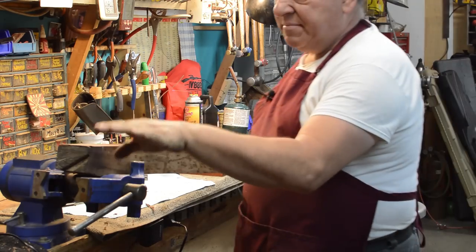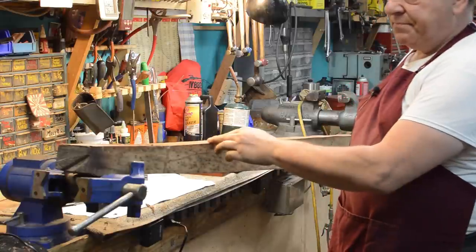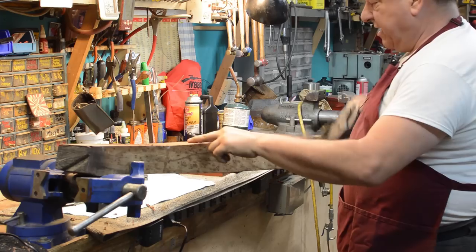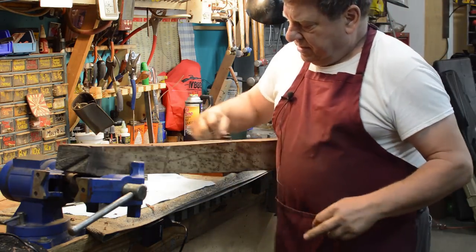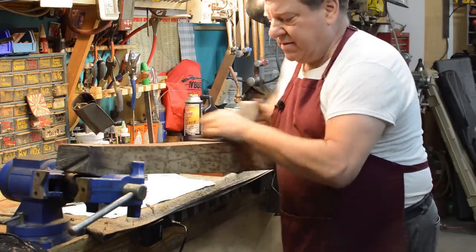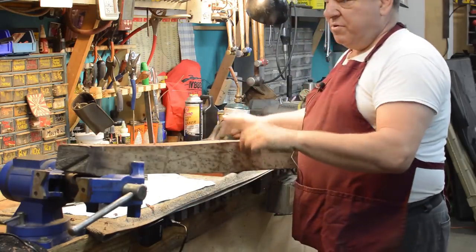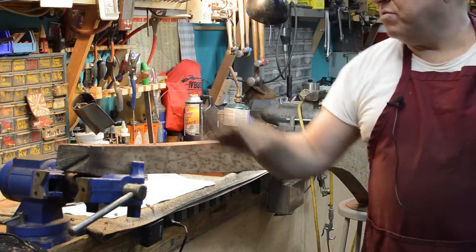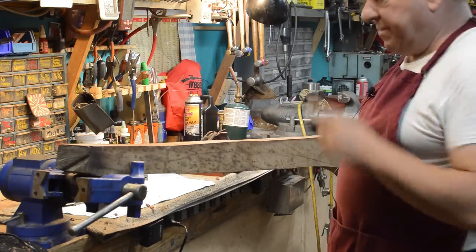Okay, as this is coming down, the cut is moving further and further this way. And the cut won't be down to the middle here till we're a long way in. And you can see that if we just mark this wood down a little bit, we could be doing this back here. But all we're doing by cutting here is increasing the bow in the surface. It's just making the bow worse, and we really don't want to do that.